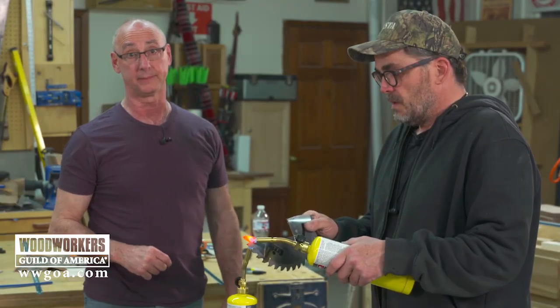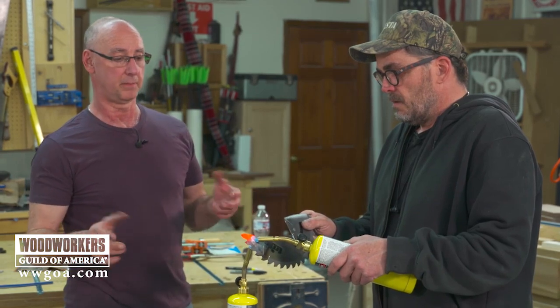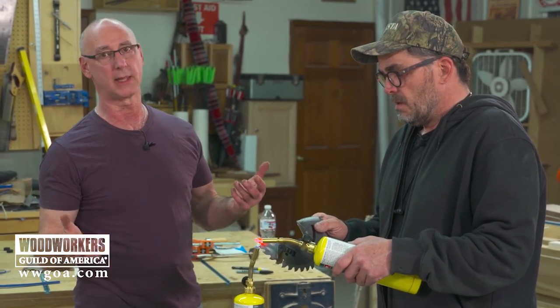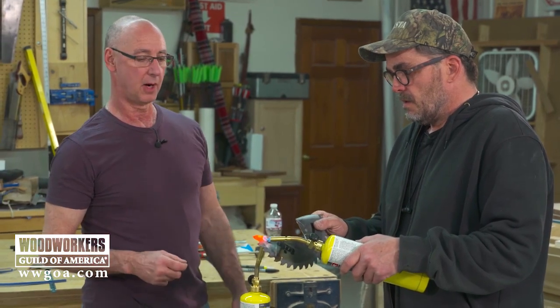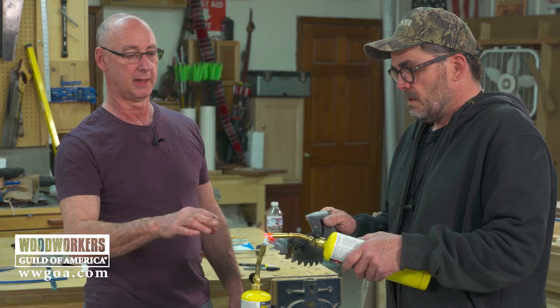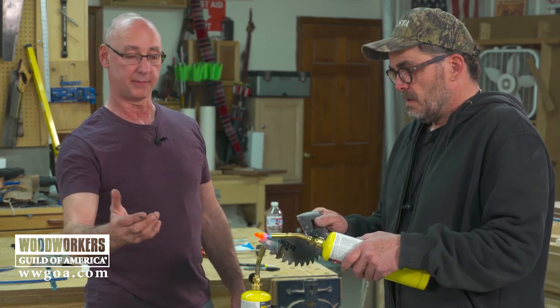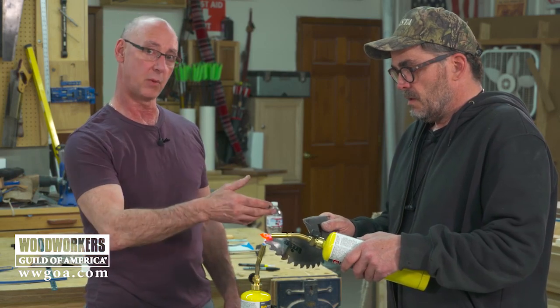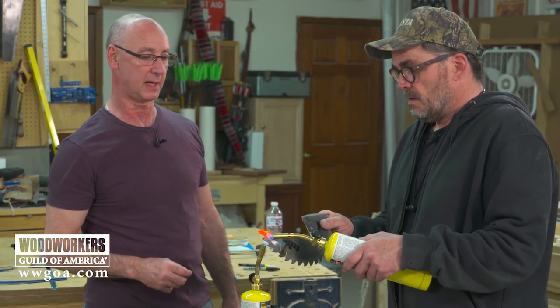So here's where we're at. We're not sure completely what we have on the metal as far as quality of metal, hardness of metal. So what Jimmy's experimenting with is an off cut from the table saw blade, and then we're gonna quench it. And the test will be, does that get it harder than what we started with? And the file is gonna help tell us that.